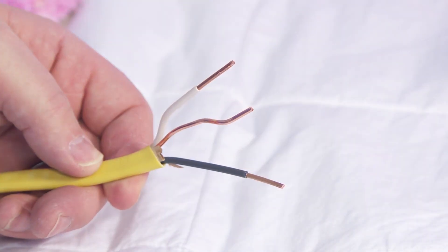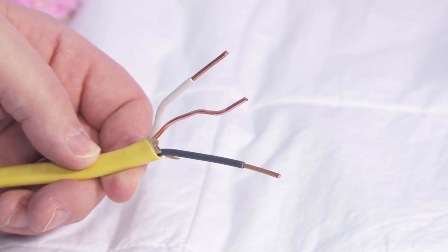The green wire is the ground wire, which usually corresponds to a bare copper wire with no insulation — that's a pretty easy thing to hook up. Then these two remaining wires connect to what used to be the two black wires on your standard switch. This switch is designed to operate a light where you only have one switch, or multiple light fixtures all tied together to one switch.